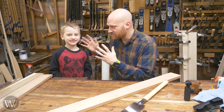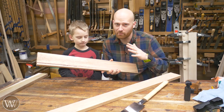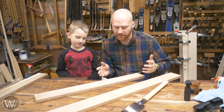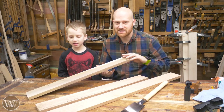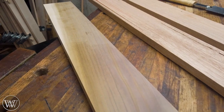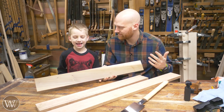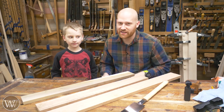If I'm going to get projects specifically for them, I want to pick something easy. If you have a Menards, they sell a wood they call mahogany — it's actually a Filipino mahogany. It's a little bit more expensive, but it's incredibly easy to work. It feels like balsa when you're cutting it, but it's a fairly durable wood and makes a really good project. Next, if you're going to get a specific wood, I would say poplar. Poplar is very easy to cut, easy to plane, simple to work with, and relatively cheap.